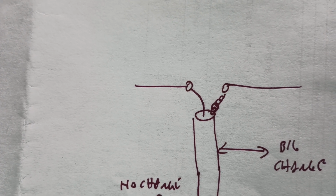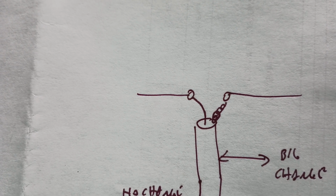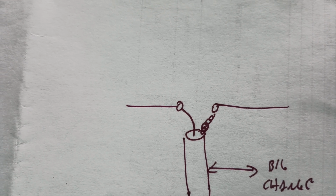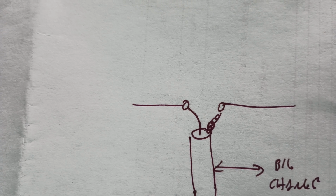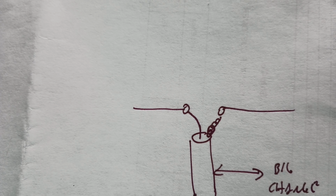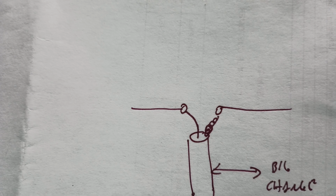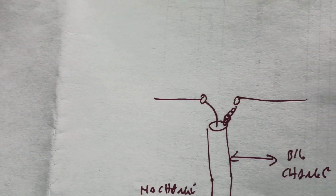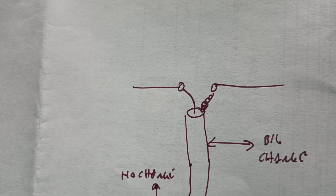Imagine that energy has just reached the end of that tubular line where the circle is, and is being coupled out on those two wires, that braid twisted up and that center conductor soldered to the wires. The charge energy has to continue on the wires, that's obvious. But it's not so obvious how the field energy also comes out and ends up a short distance away from each wire, being coupled to the ground.